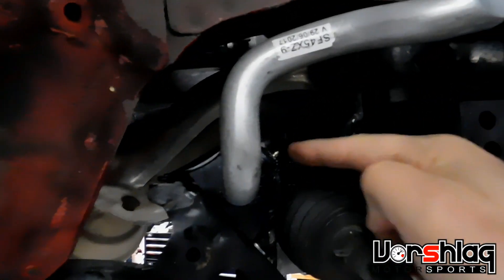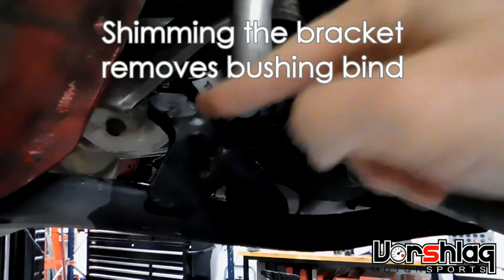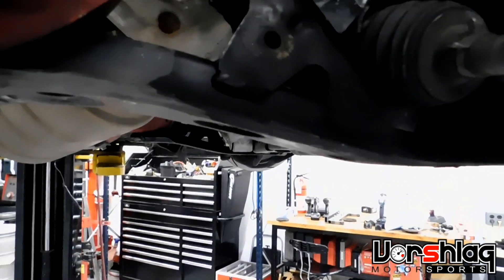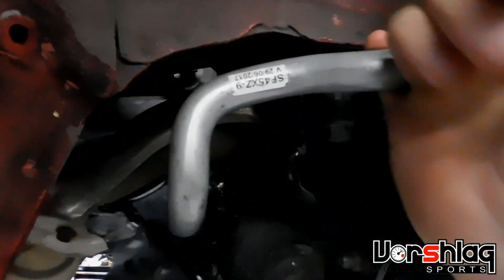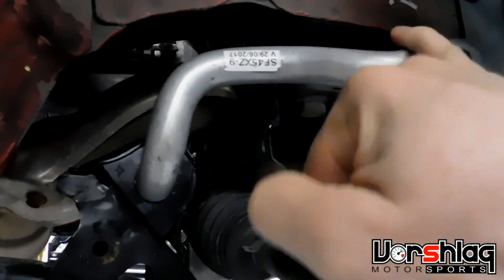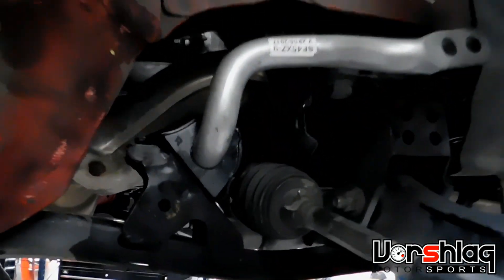The greaser has been added to the shell and it's been shimmed. You can see the washer underneath that bracket, and there's one there as well. I can move it with my pinky — it's a lot freer than before, and that's what you want. You want to be able to move this with pinky effort so you're not adding any bind in the bushings. That's perfect.